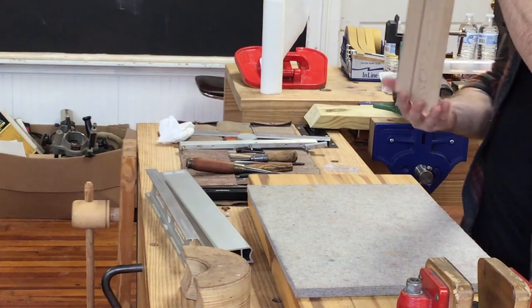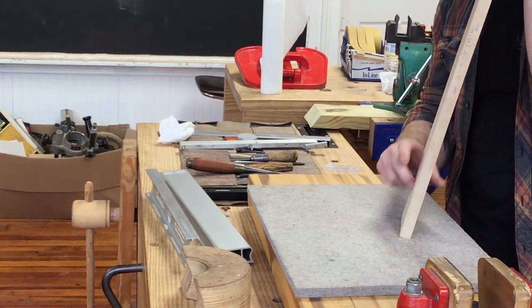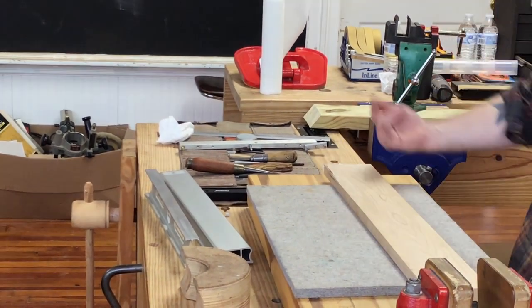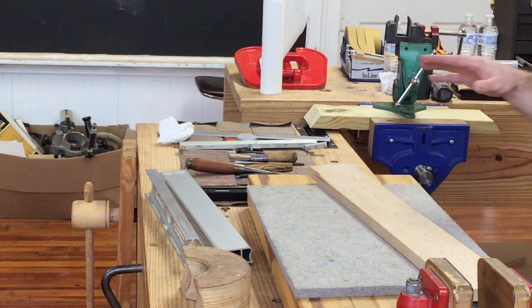And then I take a router table with the correct size router bit, and I cut my channel while that was face down with a fence, and my router bit's sticking up. So I just run it down, and I do it in like 4 or 5 passes.